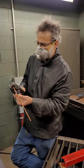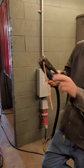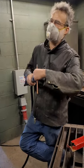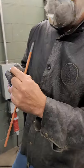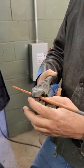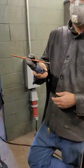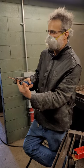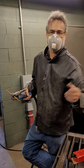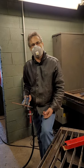Putting the coated end in like a stick electrode is wrong — this bare end is the end that we want to burn. We put this electrode in and, depending on our air pressure, we'll grab it up the electrode a little. The distance between the air and the metal where it's burning is going to affect how easy it is to remove the metal while you're gouging.